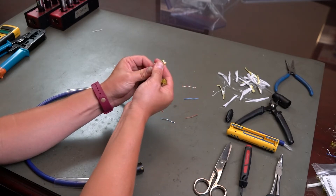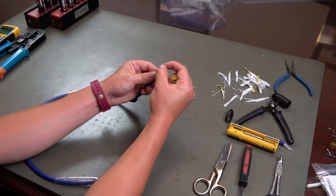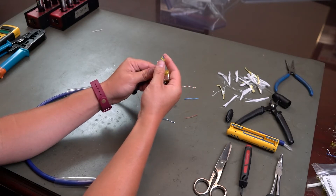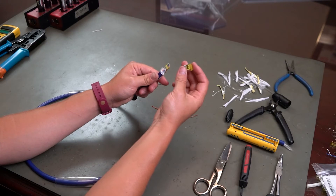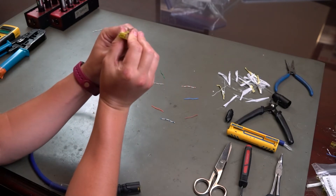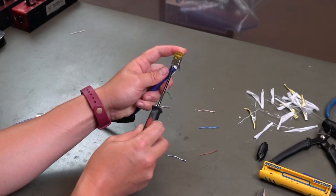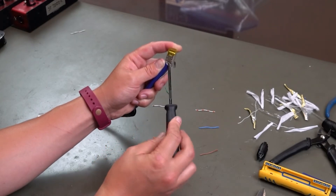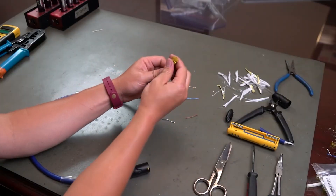And they are not in my favor. Getting these guys to fit in there is a little bit more of a bummer — they kind of have minds of their own and you've got to respect their little minds and just guide them in the right way. You can see that this one's crossing over. You don't want to let them out because it makes it so much more of a bummer. I know there are little tools that are supposed to help align this part. Ooh — I think we're happy! Sometimes, especially with these yellow connectors, if things aren't agreeing with you, sticking a little precision tool in here and just pushing can really do a lot of good for you. You can sometimes not have to reseat the whole thing, especially if it's just one little wire causing issues.